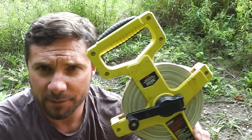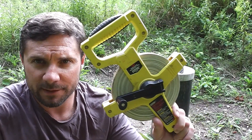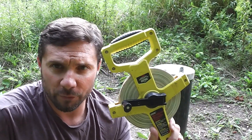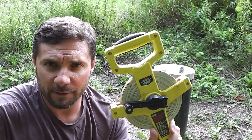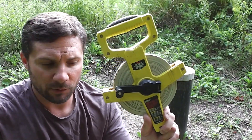Let's start off by saying what tools I use. First thing I like to use is a decent quality fiberglass 100-foot tape. Our well is 100 feet deep and the water level is typically down around 50 or 60 feet, so I feel I need a long enough tape to do that. A good quality fiberglass tape will not have curls in it, and it will also be strong in case it gets stuck down in there — you might have a chance of pulling it out.